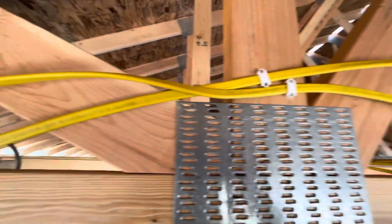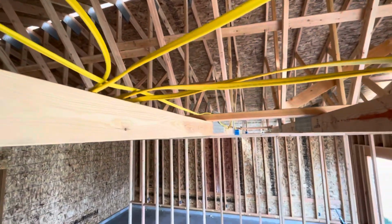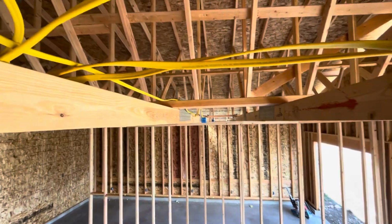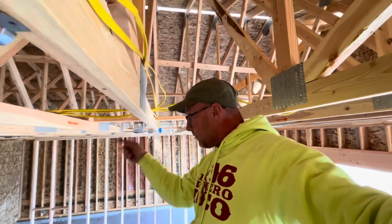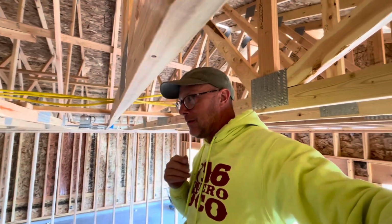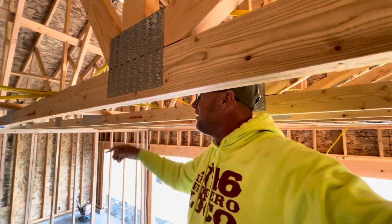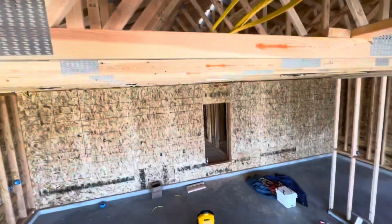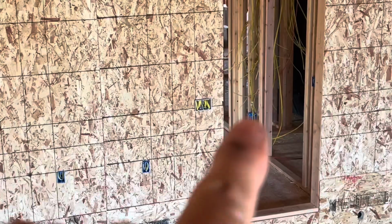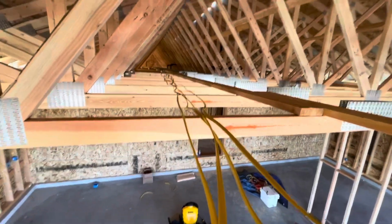So today I'm running all the garage wiring and trying to tighten it up so it's done. So we got 3 garage door openers in a row. I ran power to them yesterday from the breaker panel, and now I'm linking them together. Me and my son Matt had run all the 3-way lines, as you can see from that switch over there. So power goes into that switch, and then we have these thicker 3-way 12-3 wires coming in a channel around.